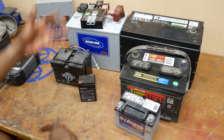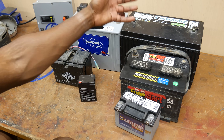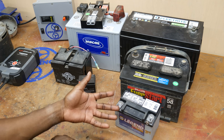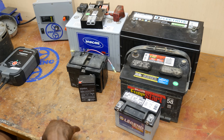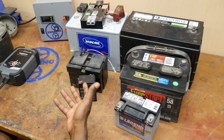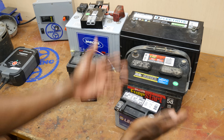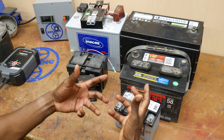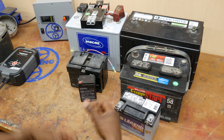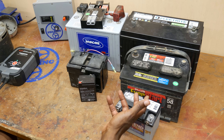There is the deep cycle battery, which would be these three guys over here, and then starting batteries, which would be these three over here. You can't tell just by looking at the size of the battery whether it's a deep cycle battery or a starting battery — it has to do with the anatomy on the inside. Starting batteries have much thinner plates, which allows them to pump out current very quickly, but the plates also erode very quickly, and so they're not designed to deliver current for very long.